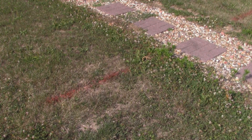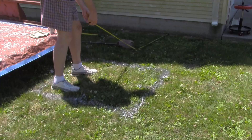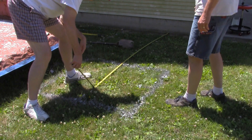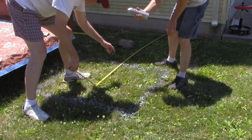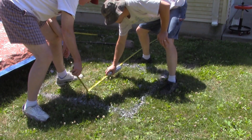Standing a signal this size required a large hole to be dug in the ground. Any time you dig in the ground, always remember to contact the local utility offices and have them come out and mark for buried utilities. We started by marking out the area where the signal was planned to go. Originally it was thought we would need a 3-foot square hole, but after further research it was decided that an 18-inch square hole would be sufficient.